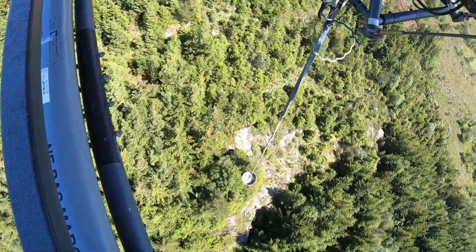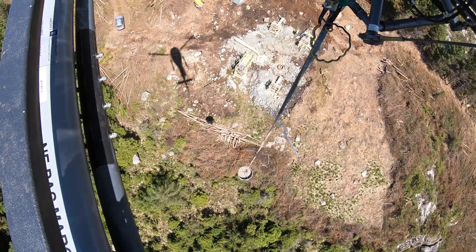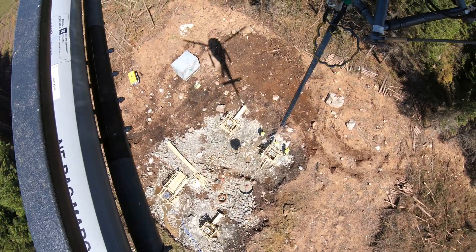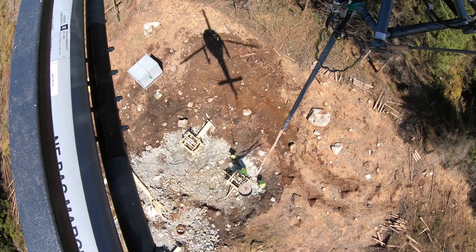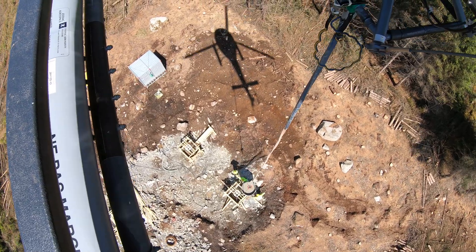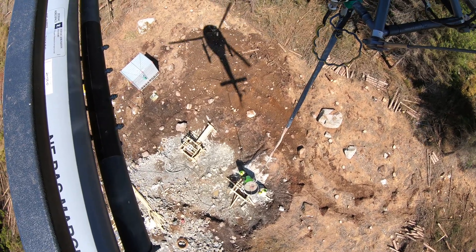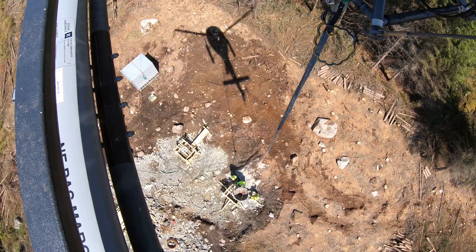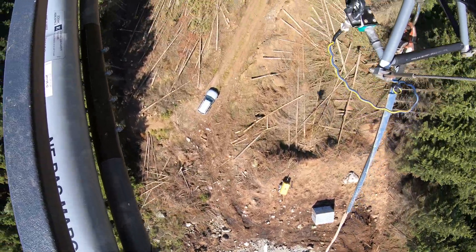In this shot we are flying concrete for the foundations of a power line tower. In this first delivery I overshoot a little bit. The approach starts fine except I'm carrying a little bit too much speed, and the slowing down is done too abruptly towards the end, causing a pendulum. The guy on the ground has to move away and on top of that we now have to spend time stabilizing the load, which is both straining and time consuming. Overshoots and undershoots will definitely happen, but working on getting that smooth deceleration on the delivery is very important. It is more safe in terms of power management and increases the predictability of the movements of the load for the people on the ground. It is also important in building your own efficiency and speed, and will save you a lot of strain in the beginning.